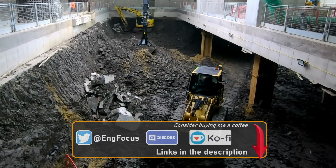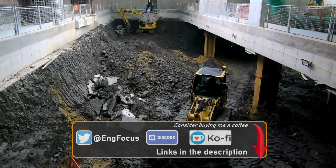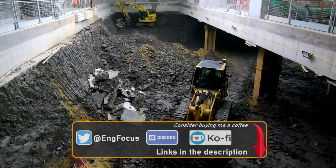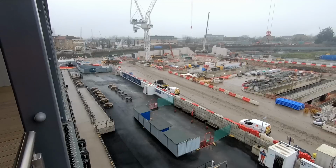The steel box structures to the right of this shot are the tops of just a few of the 160 57 metre long piles that will work in conjunction with the base slab to help resist ground heave, which is the tendency of the earth to want to push back up into the box from below.